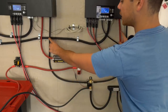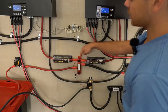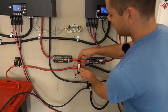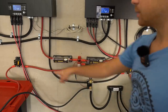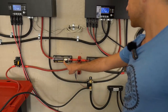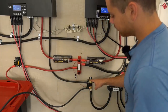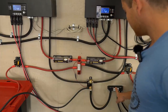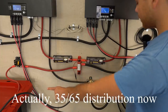I tried to organize it as best as I could. Both inverters needed equal-length conductors, and I wanted them to feed the bus bar with the same size conductor. Here's the positive — two class T fuses, bus bar — and then these two cables go out to the two battery banks. Each battery bank can supply 150 amps, and each class T fuse is rated for 300 amps. The negatives go down to a Victron shunt, which can handle 500 amps.